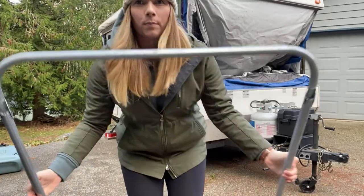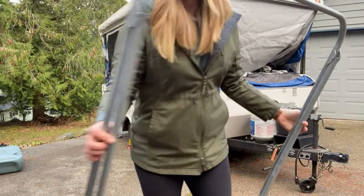So your next step is going to be to pull the beds out. But before you pull the beds out, what I like to do is put the base bars out, so that when you're pulling the bed out, it's not dangling there with no weight pushing down on it, with no support. The first support that we put at the front is this one.